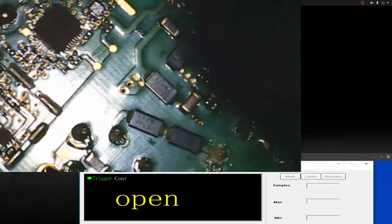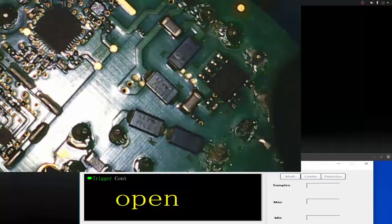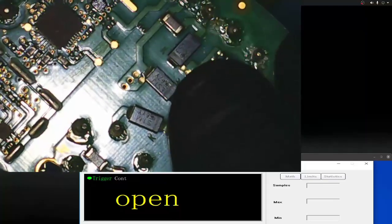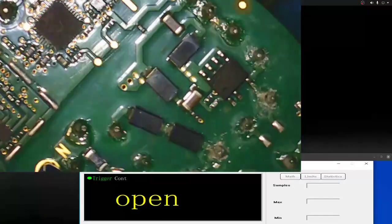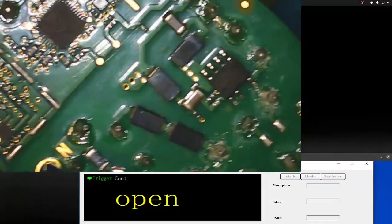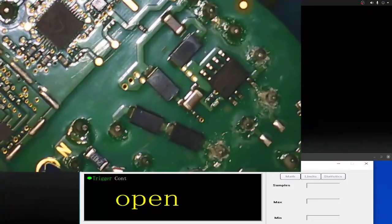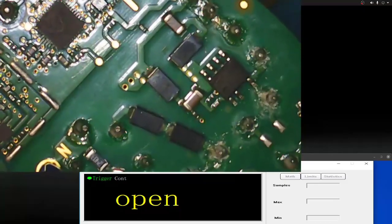I say we've shown that there's no connection, and even in an ideal world where conspiracy theories are true, there is no physical way that these packages are going to take that kind of voltage anyway, and there's no way it's going to end up somehow in an MCU that's rated 3.3 volts and has a very, very weak output, and the packets, for instance, like 64 byte payloads. And even in the Silicon Labs manual, they specify that you shouldn't run it more than once every 15 seconds. So that's 64 bytes of data every 15 seconds. I'm going to call bullshit on this.